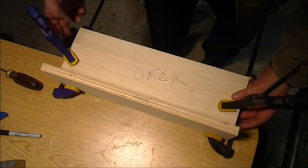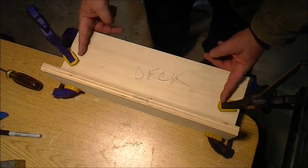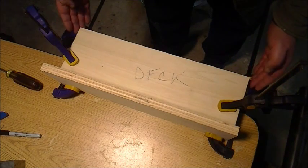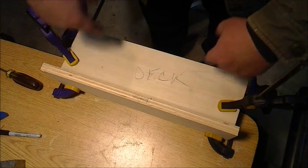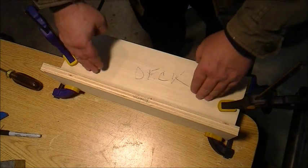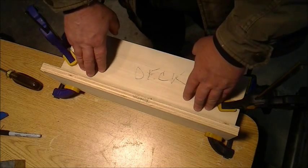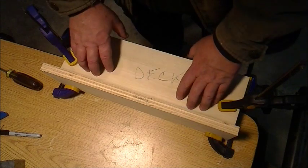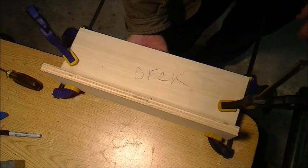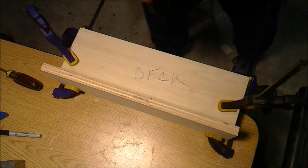So you've got your one, two, three blocks underneath here. Tuck these clamps in about here, so that you can put these two clamps on — the ones holding the face to the blocks — close in. That lets you hang this out and get these clamps in so everything's nice and square to those three blocks. The three blocks set your height; that's the top side down of the deck at two inches so it fits your foam perfectly.